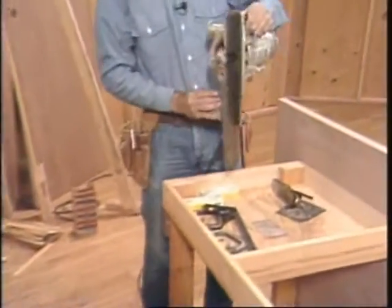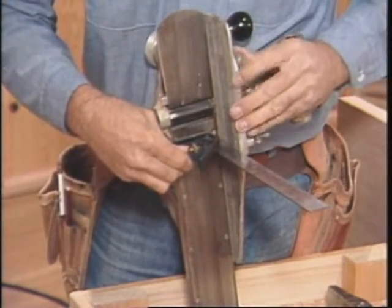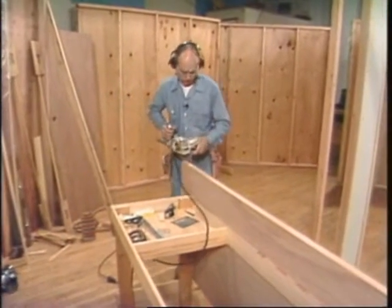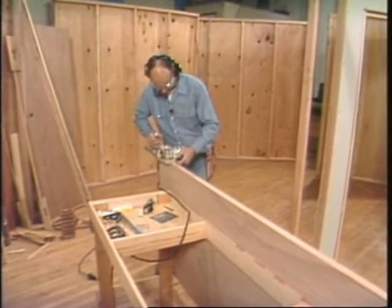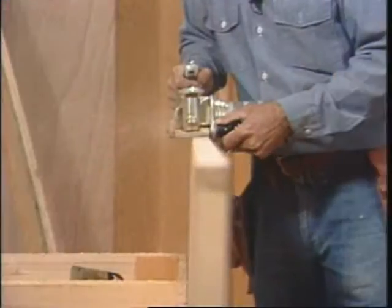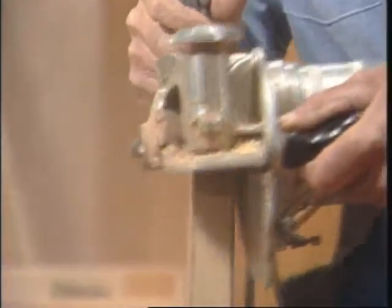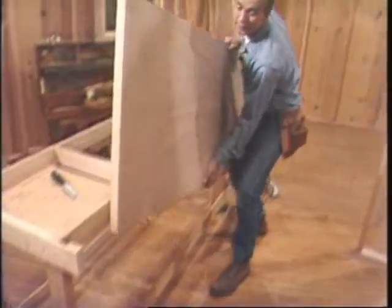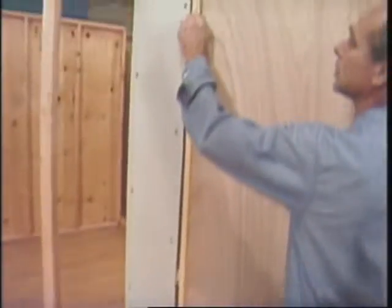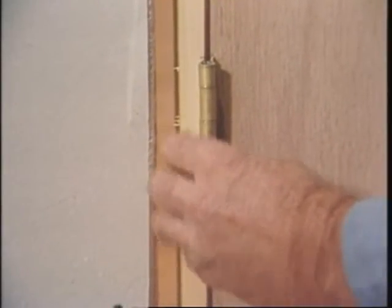This electric plane is about 25 years old but it still works really well. It has an adjustable fence. I'll check the square and set the bevel to about five degrees. Make a series of cuts — the first one will be narrow, and they'll get progressively wider as I go down. I like to use old hand planes, but electric planes are for speed. You can see the bevel on the machine, and now you can see it on the edge of the door. It's ready to hang now. I'll try it and see how it fits. I'll mate the hinges, put the top pin in, then the bottom pin, and close it and check the margins.